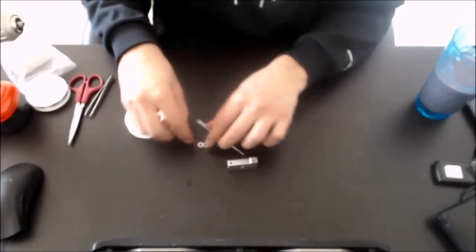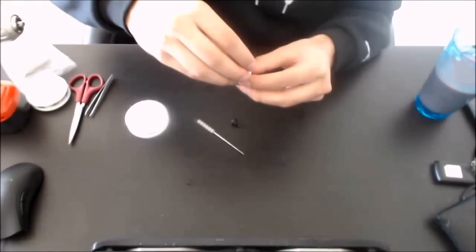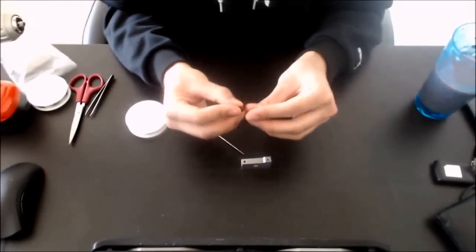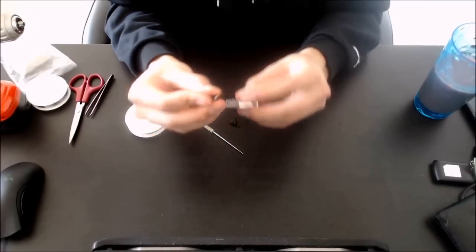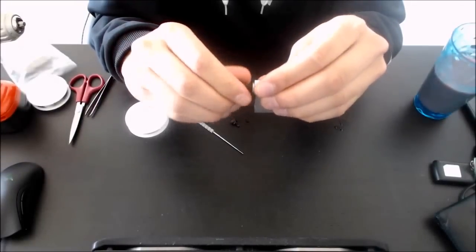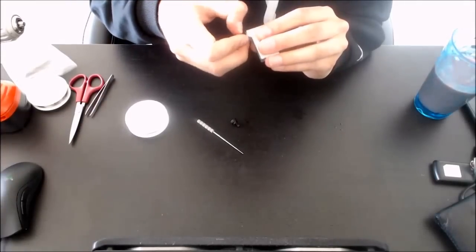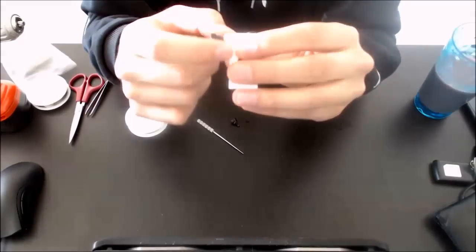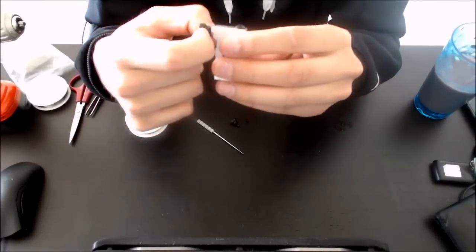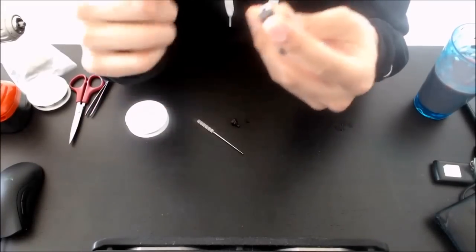You'll take this over here and get the wire that you want to wrap. You'll start off first with a spring on this guy and then two washers — that's how it goes in. You have the spring first and then your two washers. That goes in there. Tighten that up a bit. When you cut the spring, you might see that it's starting to go over that little knob. Make sure you tuck it back so the pressure is being pulled against the knob, otherwise you're not going to have pressure.